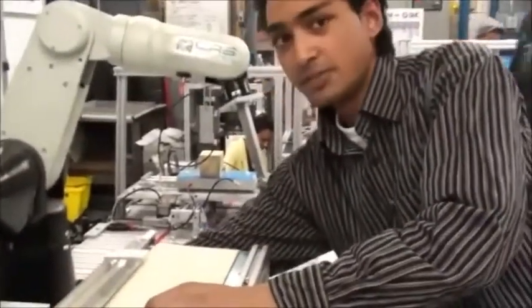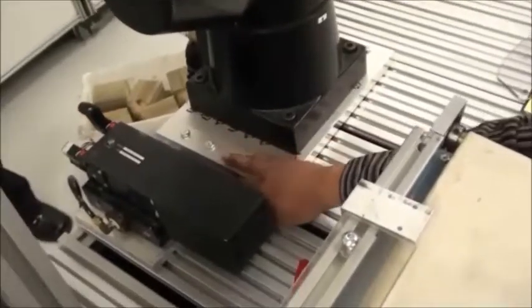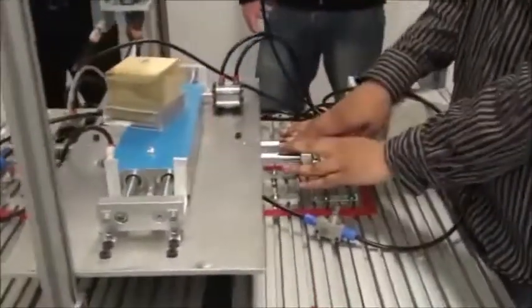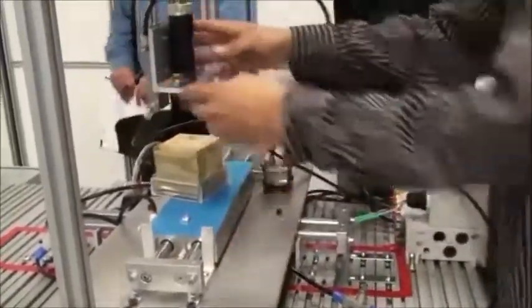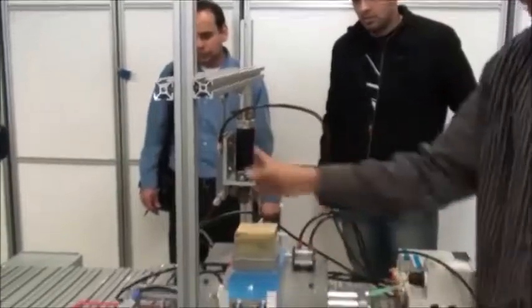Today I'm working on a base for the vacuum — I just have to drill some holes and tap them so I can mount it to the table. I also had to make a base plate for the pneumatic sliders, with brackets to hold one pneumatic slider, then a base to hold the next pneumatic slider so it can move like this. And I used four extrusion rods to hold the pneumatic slider for the drill so it can go up and down.